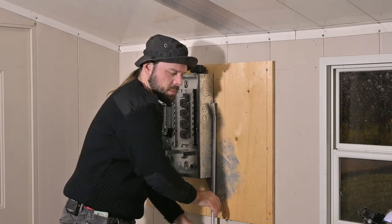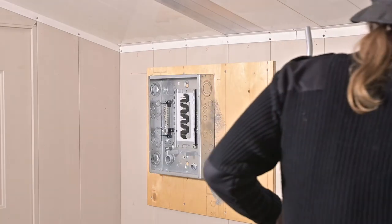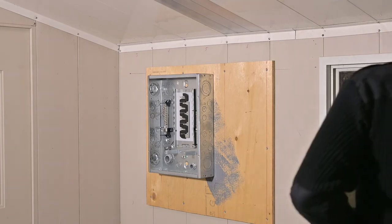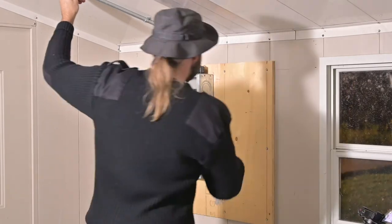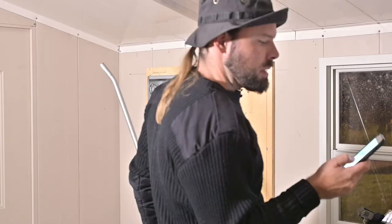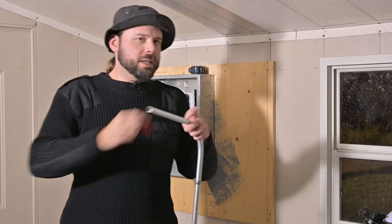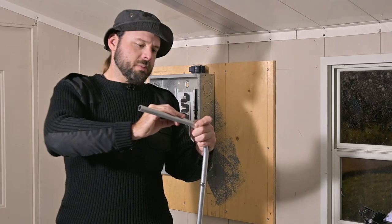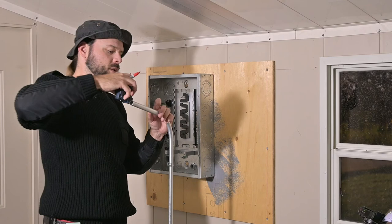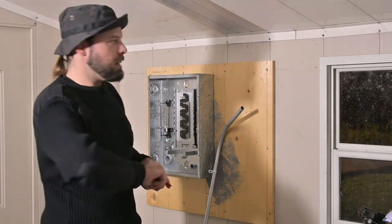Let me consult my documentation. Distance to obstacle: seven inches. Seven inches divided by 0.25 — I've got to remember how this works. We can start with this mark here, and then we need it to move 1.25 inches. Times two — the second mark is going to be at 2.5 inches. We'll try to bend it here, and then the second bend is going to be at 2.5 inches. And if I do a 30 degree offset, that should hit my mark.